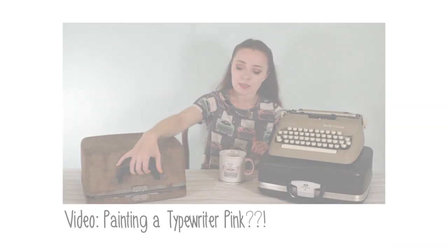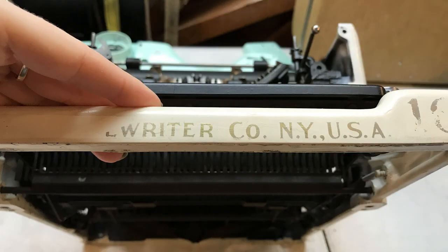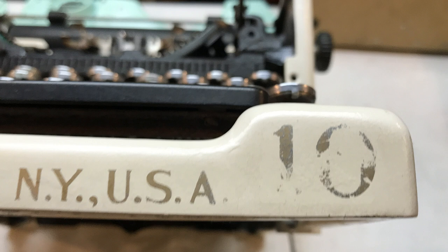Another really important lesson I learned was how to do a proper paint job on a typewriter. This project was done before I did my estate sale pink typewriter video, but when I did this one I didn't fully remove the paint underneath — and that is something I would totally do now. The original paint I did sand down to make smooth, but there are just some texture issues in the paint job that I kind of painted over, and it doesn't look pristine or perfect. I'd probably sandblast the original paint off or remove some of that original finish so that when the new finish goes on, there's no chipping underneath and it has a nicer, smoother finish. I actually had a decal on this front panel covering a bad texture issue, and as we were doing adjustments we wore off that decal, so now that texture issue is more visible.